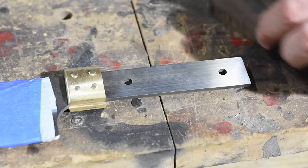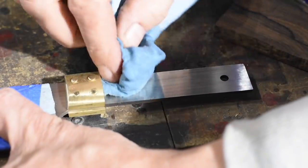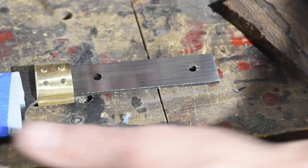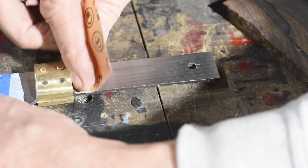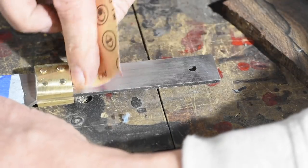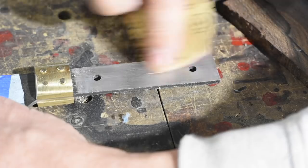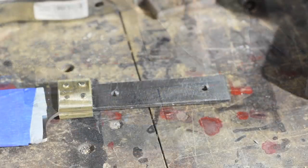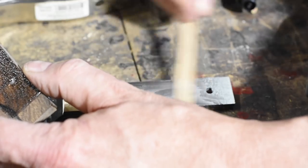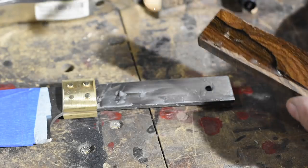What follows is more of the sort of rigmarole that demonstrates why I don't make knives with bolsters very often. The issue is that you need to get the scale to fit perfectly flush to the bolster. If you try to just drill holes and then trim everything to fit, the likelihood of ending up with an ugly gap between the surfaces is about 97.83%, approximately. Of course, we can do a bunch of milling and measuring like we did with the bolsters, but wood is not built for holding thousandths of an inch tolerances.